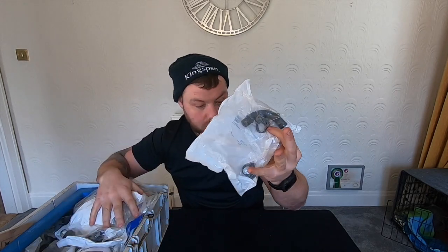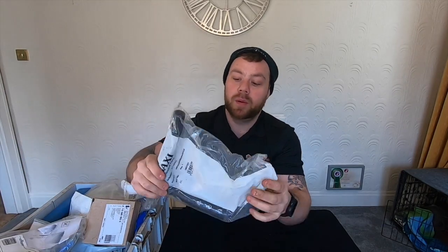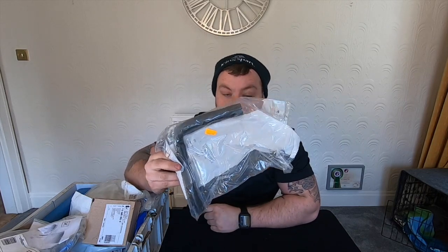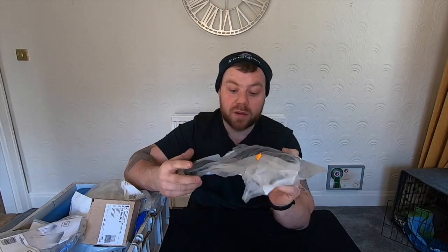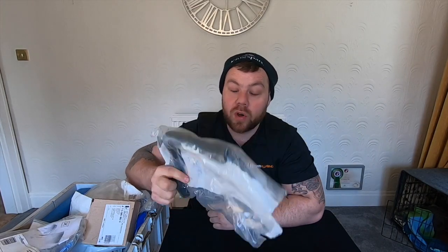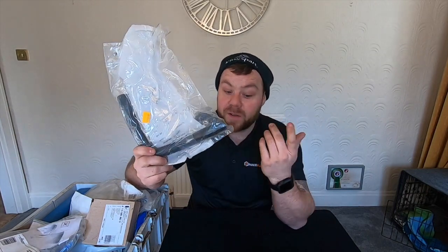Gas tube — Green Star. Top tip: this is the upgraded condense tube for Baxi Duotec. What you find is you'll find a load of water in the combustion chamber for no reason and you'll be thinking where the hell has that come from — it's come from the old condense tube. Get a new one of these, upgrade kit, fairly cheap. Always good to have on the van — first time fix, customer loves you.